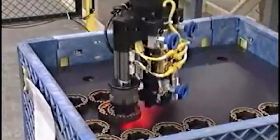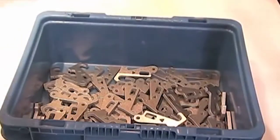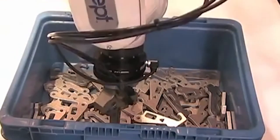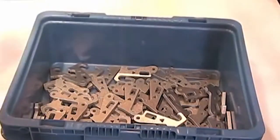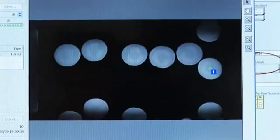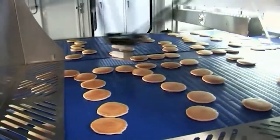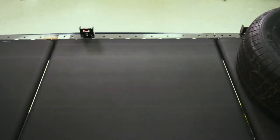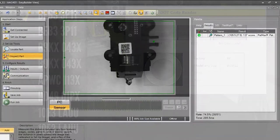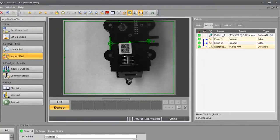One of the things we normally use the LR Mate robots for is machine vision activities here in the lab. Machine vision is the use of a camera to help the robot find parts, check their size and shape, or even to confirm their identity. And while machine vision isn't restricted to FANUC robots, these are the robots we have that currently have cameras. We also have a Cognex brand vision system. This system allows for part matching, barcode scanning, pattern matching, measuring parts, and even communicating with the PLCs and FANUC robots.